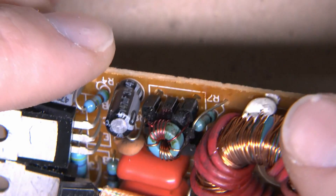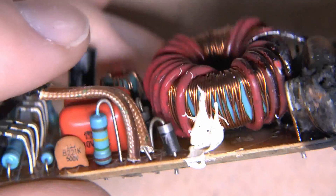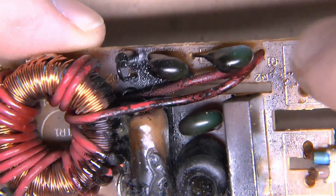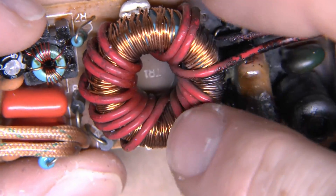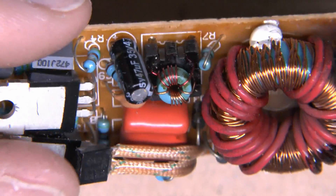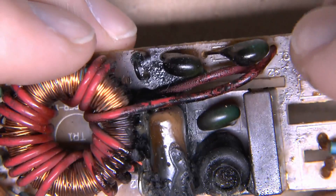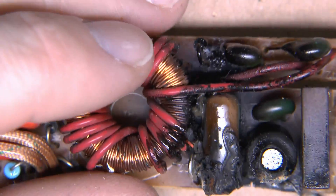There's a small capacitor and a miniature coil on a base, and of course your main coil there with the primary and secondary one over the other. That's what provides the output. There's not any particular smoothing on the output — it's basically just whatever frequency this runs at. The red winding comes across directly to the output. It's not a whole lot of circuitry, but since it's just driving a halogen lamp it doesn't actually matter whether it's DC or AC, because at the frequency this runs at it's not going to have any visible flicker.